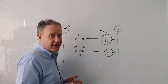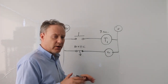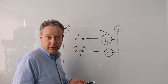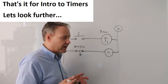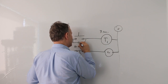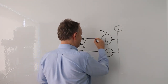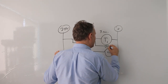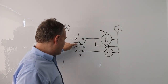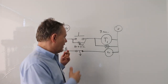Those are the four contacts you can have for a timer — two for on delay and two for off delay. For now, just focus on on delay: normally open or normally closed. Of course, if I didn't want to hold the button, I'd put a holding circuit here. I'll sneak in a relay R1, with contact R1-1 as the hold. When I press the start button, that energizes the timer and energizes R1, which holds the signal so I can release the button.